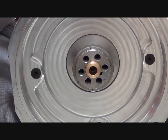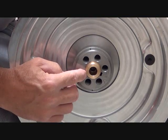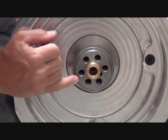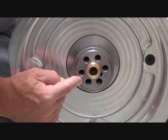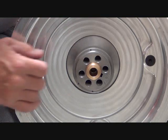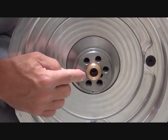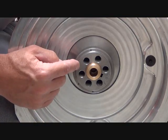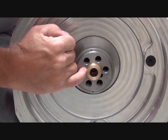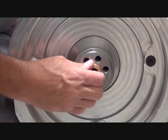It's impregnated bronze and it's machined to the specs that we need. In this particular case, there's a difference in the OD of this portion, which is where the flywheel is going to sit, and our motor shaft on the coupler here. So there's actually a little step in there. This was machined so that we would chill the bushing, slip it in place, and once it's in place it's locked in there. It cannot go this direction because it bottoms out against the motor shaft. It can't go this direction because of this little step, which is going to be held in place with the flywheel once it's installed. And it won't spin because it's an interference fit.